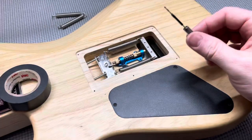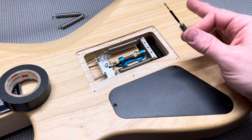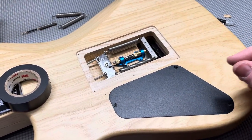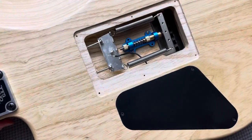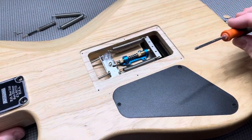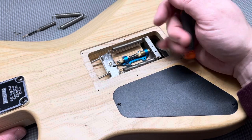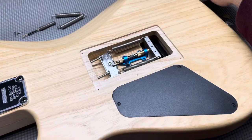When you're working with wood, the best advice I can give is to always pre-drill the holes — even if they're self-tapping screws, still pre-drill them. It keeps you from splitting the wood and causing problems you don't want to have. I already put two of the screws in to show you what's going on. Make sure you have a good Phillips head screwdriver that actually fits the size of the screws so you don't strip out the heads.